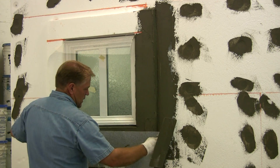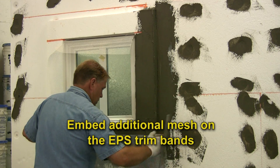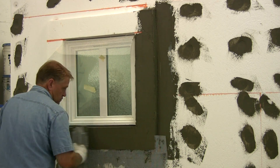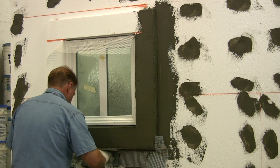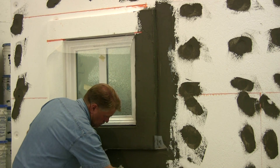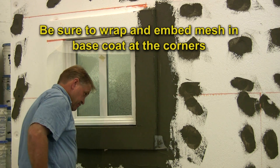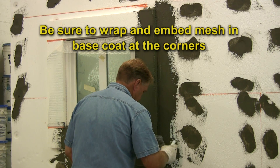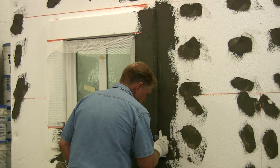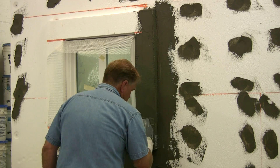With this piece, we're going to run it beyond the outside edge — our fiberglass is down to here and I'm going to lap that more than two and a half inches and wrap it beyond. I'm going to tighten that up and make sure I pull that into the corners, cutting and trimming the outside and inside corners so I can wrap that up the wall and around the corners. We're going to make sure that we have the corners completely wrapped with fiberglass mesh and base coat.